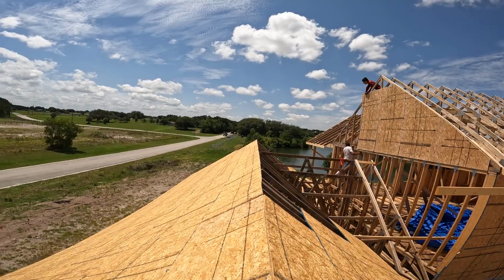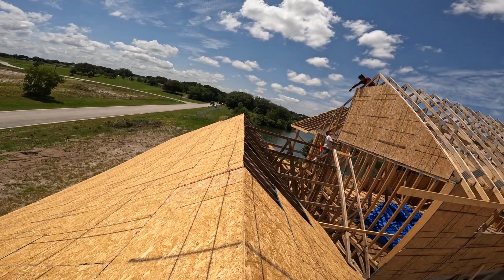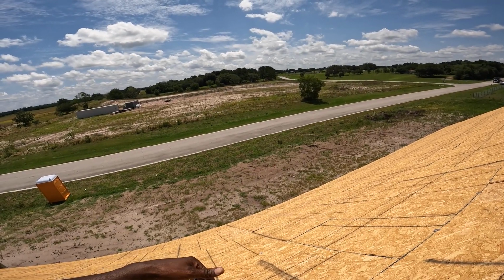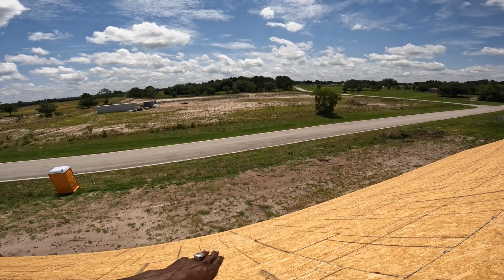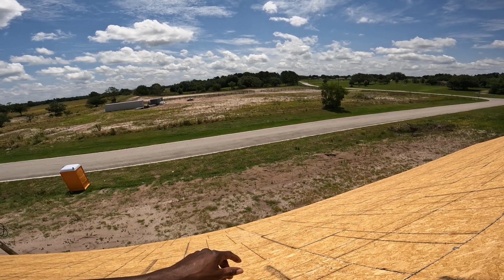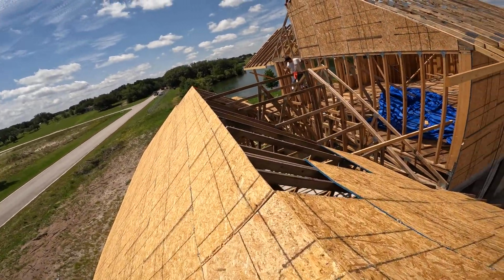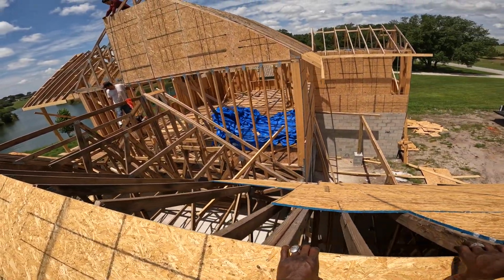Then the other side, the back of the A-frame, is also sitting wrong. Meaning up and down, some are moved too far into the CMU block wall, which pushes it on one side to go further out to the exterior of the CMU block wall, maybe about an inch. I've seen some, which I have pictures of, that's hanging out from the rafter fascia of the roof.